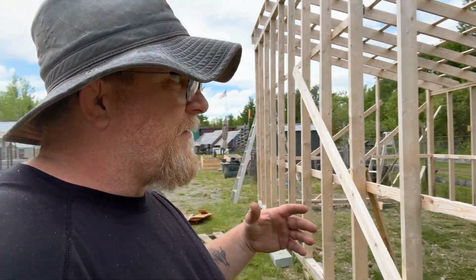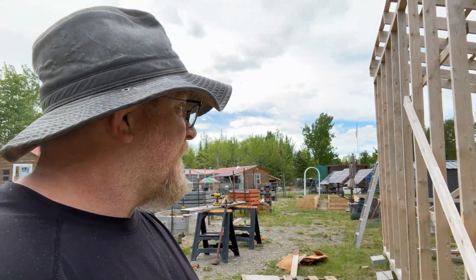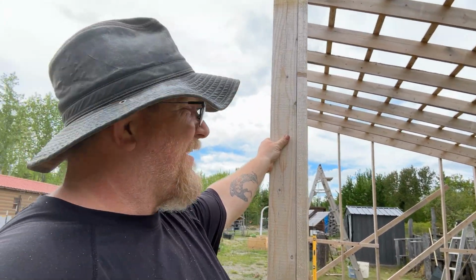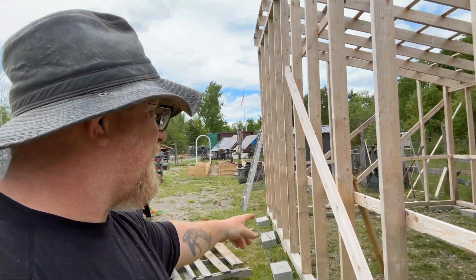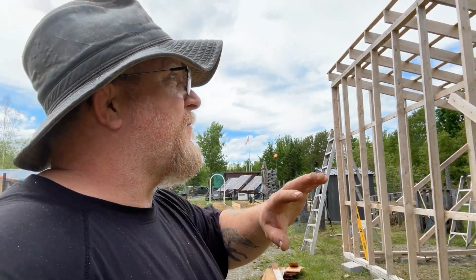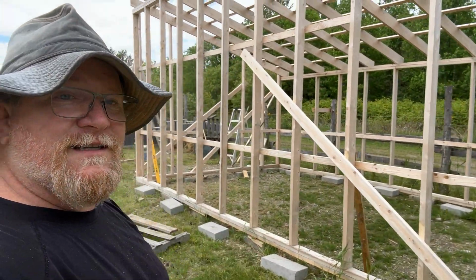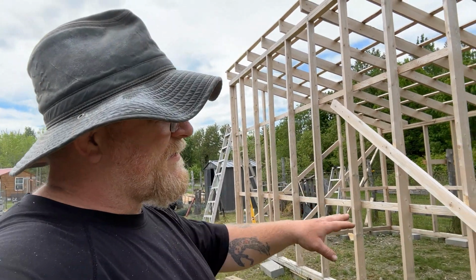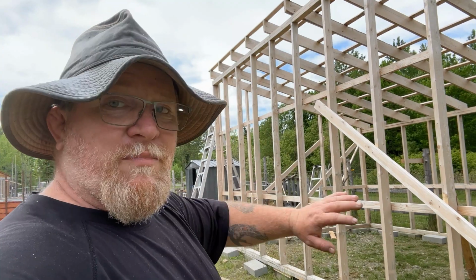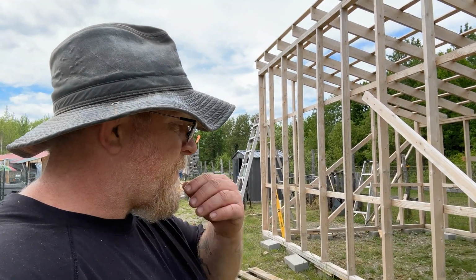The other thing that Jen and I had to do is get the building squared again. So basically I just kind of hung on the edge and pulled the building, and then Jen went ahead and put in some braces for us. So now that the building is completely square, we've got all of the bricks and the insides cleaned out. The next step here is to get all the blocking underneath the foundation here.